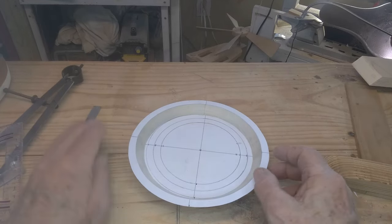And the other one, I was supposed to have stopped between the inside and outside and glue the bottom on and then sand it. But this time the bottom is going to be flipped over, inverted, and I've got to cut it in half about a quarter inch, and it's going to be the base. So I'm going to sand it independently. I'm going to sand both inside and outside of this and get it as nice and smooth as I can. It lines up really nicely. I'm really pleased with the way it's fitting together. It's making a nice smooth size, won't take a lot of sanding. So now I'm going to work on getting those rings glued together and I'll work on the sanding, and then I'll figure out what I'm going to do with this, sanding, planing, chiseling, whatever, to get that down to about half.